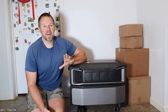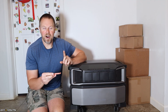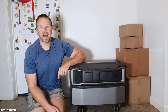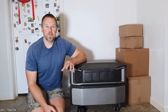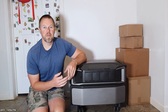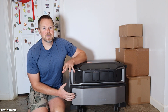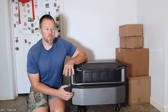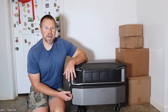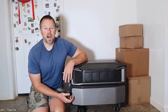And the results are in. I did not adjust my usage at all for this refrigerator — just normal everyday stuff. I first started the test at 9:30 AM on November 7th, and I ended the test at 9:30 PM on November 9th. That is a total of 60 hours run time with the single battery. Now I kind of envision that if you have a grid down situation, you're going to want more than just the fridge — a couple of lights, probably internet and TV, and maybe a well pump. This inverter is powerful enough to run a well pump. So without any kind of solar input, you're probably looking at one good day of power. But with just the refrigerator, 60 hours — I feel like it is a pretty good deal. If you're looking to do a whole house backup, I probably would go with two batteries and have some solar as well, and you would be good to go for the typical power outage of one to three days.